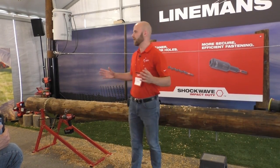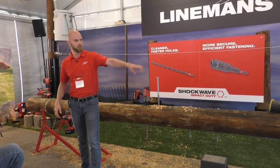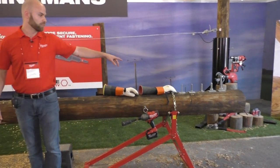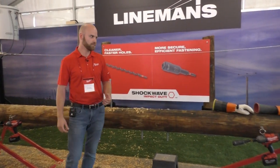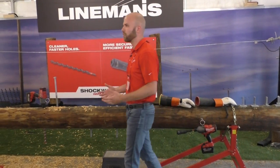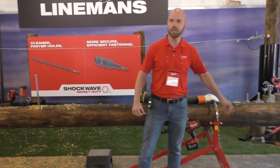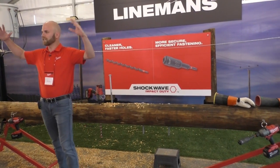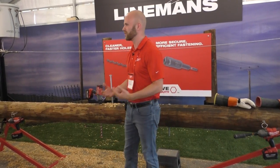While there's a vast array of lengths for these machine bolts, there are really only five different diameters you'll find on a pole, as you can see on the bar graph here. These five sizes are going to be half-inch, five-eighths, three-quarter, seven-eighths, and one inch in diameter. The three smaller sizes are for distribution poles — the residential wooden poles you see outside your house — whereas the larger two sizes are for transmission: the larger wooden applications like lattice towers or large two-pole towers along the highway.